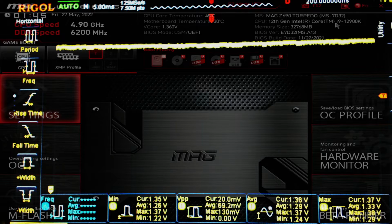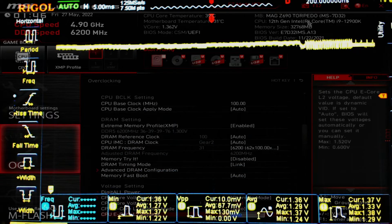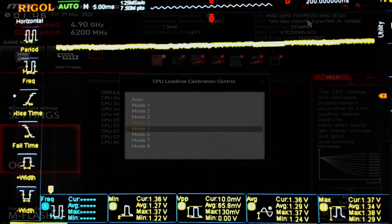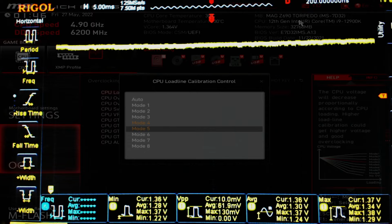In fact, I also tested 750 kilohertz before making this video, and 750 is also terrible. So, honestly, I would just leave it at 500 kilohertz. And then, other than that, for the actual V-droop amount, 3 and 4 is probably as droopy as you need to go. Because the results are good. And then you have 5, 6, 7, 8, but I don't see any reason to use 6, 7, or 8. I really don't. Maybe mode 5 might be slightly better than mode 4 and 3, but I already can't measure a difference between mode 4 and 3, so I kind of doubt it.